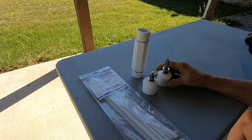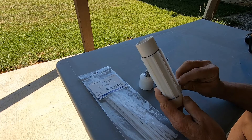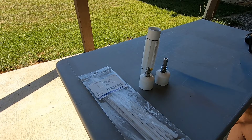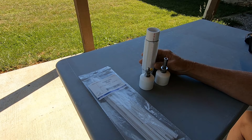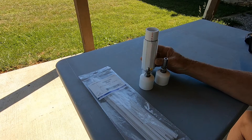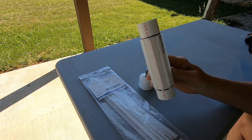It will tune from 6 through 40 meters — for 6 and 10 meters you'll probably need to shorten the antenna a little bit. You need about 35 winds of wire; I think there are 36 here. The coil is about seven inches long and costs maybe about $25 total. It's small and lightweight — I use it on my Jeep on a mount and also with a single magnetic mount. Both setups tune to about 1.4 to 1.5 to one SWR using an MFJ analyzer. The next part will be drilling a couple of holes and winding the wire onto the coil.